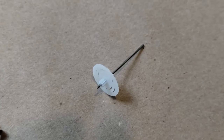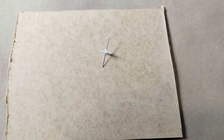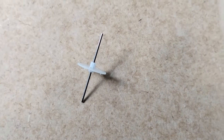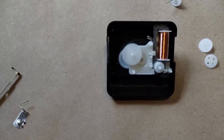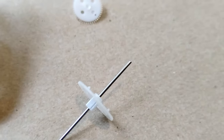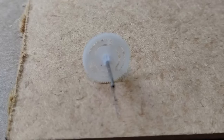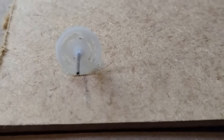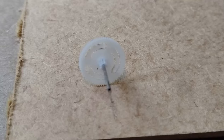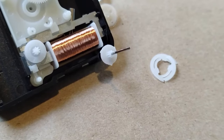On some clock movements like ours, the second-hand gear was originally on the bottom. That is not how we want it on the driver clock — it needs to go on top. You'll want to take the wire that is pushing through the second-hand gear and push it to about halfway through the gear. Press it against your wood block, being sure not to poke your fingers. After that, take out the two contact leads. If you look at the second-hand gear, you'll see there's a smaller gear in the middle of this larger gear — you'll want to put that facing down. Next, take your cutters and cut the outer gear off of the second-hand. You will see cutouts with little tabs around this gear — cut it out at that point. After cutting, it will look something like this, with the outer gear gone and the smaller inner gear still in place. Now, put the smaller gear facing down, meshing with this larger gear here.